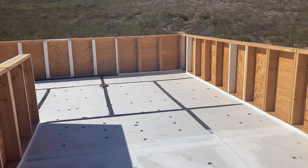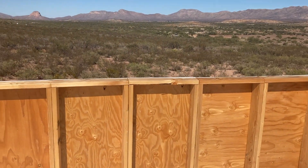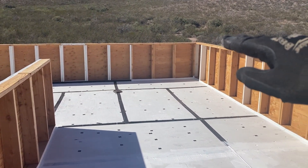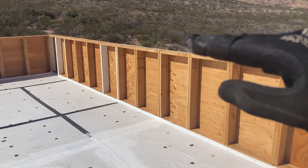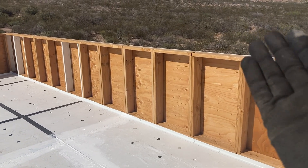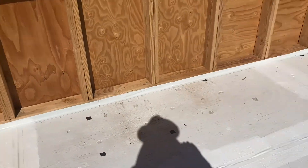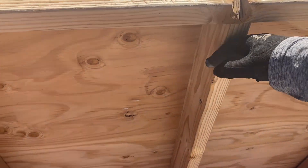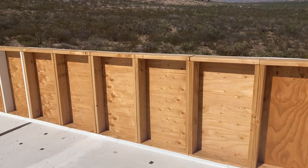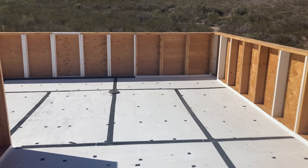There are a lot of next steps — I'll run through some of them quickly. I want to put another top plate all the way along the parapet, probably using 12-foot 2x6s, just to get it as straight and level as possible. I already talked about adding another layer of plywood across here. Then I've got to do the cascading ramps. Before that, I have to sheathe the inside of the wall. Then the ramps, then the foam insulation, then the rubber, then sealing the rubber, bringing the rubber up over, coping — it's a lot of stuff. Gravel's coming up here too. We'll save that for another video when I actually get to that stuff.